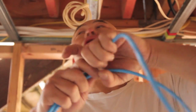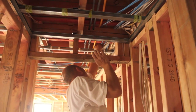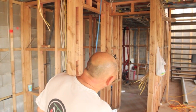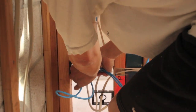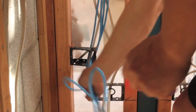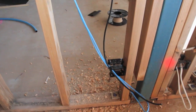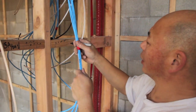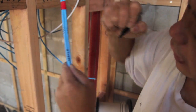You've got to be careful with the cable — not to kink it. What are the rules, Shane? You've just got to keep the cables away from power — that's the most important thing. When there's power going through a cable, it creates a magnetic field, and it can affect your data and give you interference on your RF as well. Make your runs neat and tidy; you don't want them crisscrossing all over the place, as that makes it harder for the electrician and your builder later. Mark the cables so you can identify where they're going.